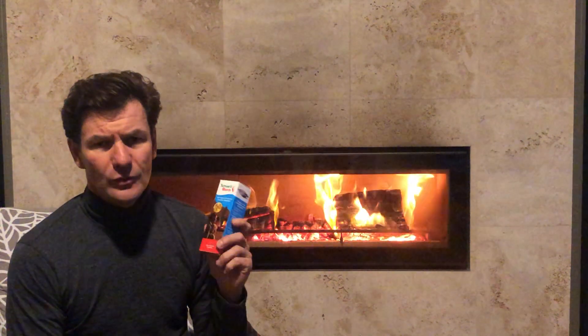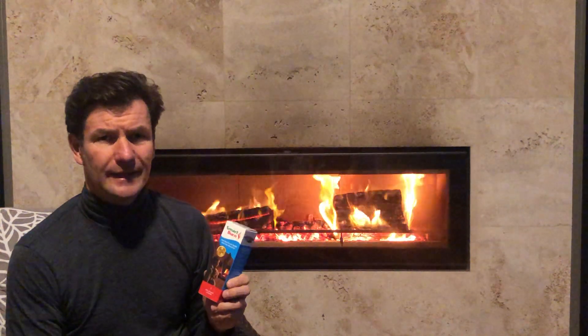I want to address two particular issues that we're getting a lot of phone calls about in our office. The first one is: do I need to sweep my flue before I use the Smart Burn, or will the Smart Burn on its own clean my flue? Smart Burn is designed as a chimney flue cleaner and it will clean a flue, and it will unblock a mostly blocked flue and keep that flue clean for about the three months lifespan of the Smart Burn device. As long as your flue is not so blocked that your fire won't start or draw, because obviously the Smart Burn needs to get hot to work.